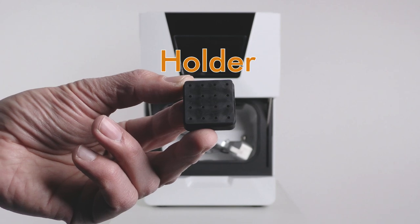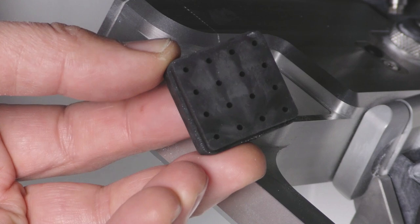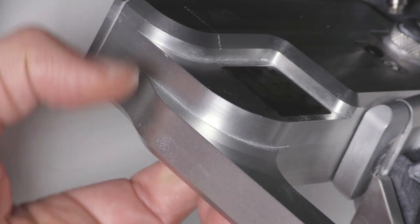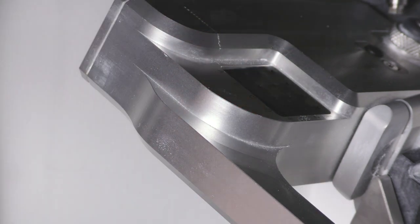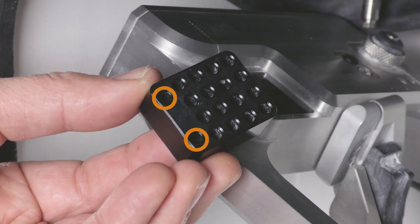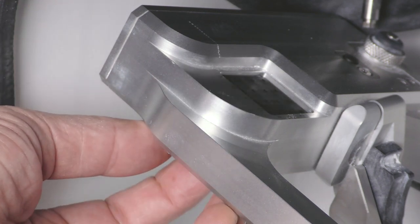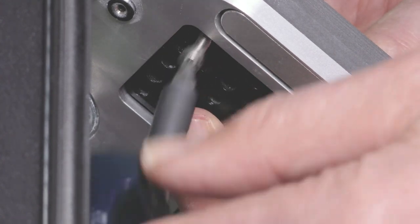Get the required spare parts. Insert the tool magazine insert from below into the opening and clamp it. Ensure that the top of the tool magazine insert is flush with the surface of the AB axis module. If this is not the case, correct the position of the insert. Align the holder so that the screw holes are located at the front edge of the opening. Insert the holder into the opening. Insert the two screws into the screw holes in the holder and tighten it.